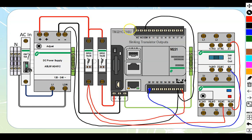As mentioned before, there is danger with U-type sinking outputs due to ground faults. If the DC power supply is grounded and we get a fault on the line, there is a false current path available: positive travels through the normally closed contact, through the coil, hits the ground fault, and returns via ground to the DC power supply — turning the load on unintentionally. This is the danger created with sinking-style outputs. Watch video 2 for more on that.